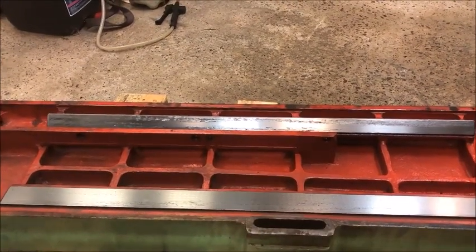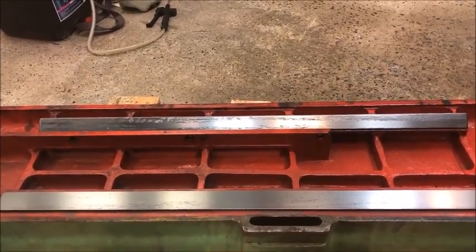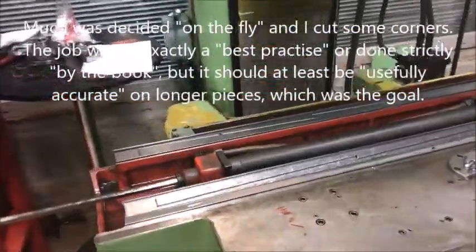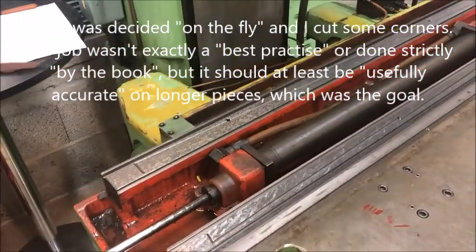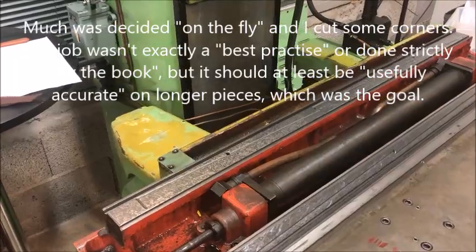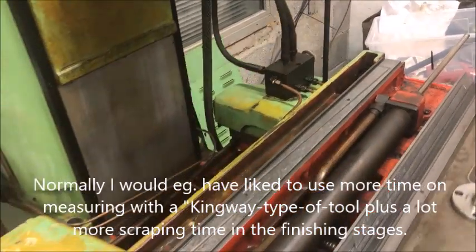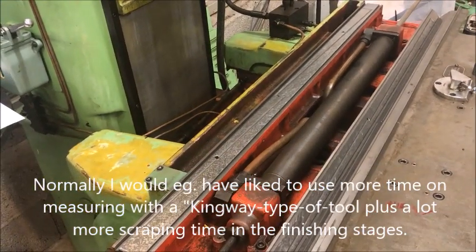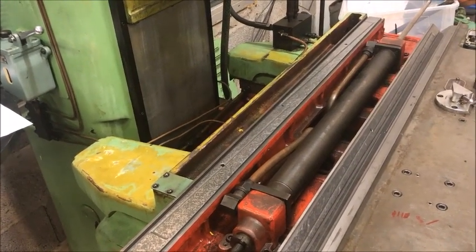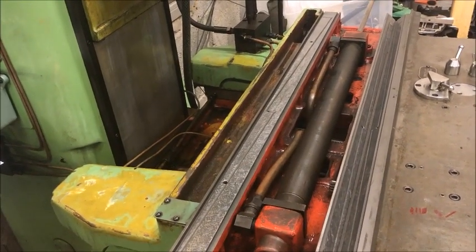This was an operation starting at nine o'clock in the evening, and we ended up roughly four in the morning. And the owner would like to leave it as is now, so it was only a part restoration really. But these ways are flat, and I've tried it with a table on, so we have pretty much, we are pretty much where we want to be with relation to having kept the original geometry.